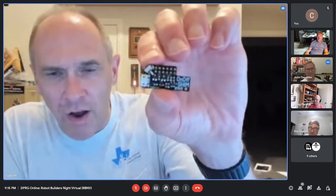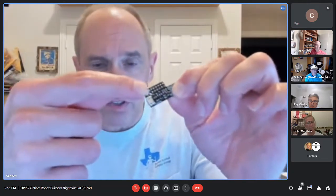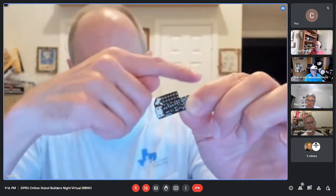Oh my goodness. So I would ask you, John, but the trouble is I went on a shopping spree and I got the Pimoroni on-off shim. I have several copies of this. It's not as capable as yours, but it comes with a script. You can mount this board. It's thin enough that you can cut the header away from the Pi, and you can mount this board on top of the header pins, and you can still put other things on top and use the header pins. You would then power the board through here, and then this button, I think, must have a similar function as your buttons. When you first apply power, nothing happens. When you push the button, it powers up. And then if you want to do a graceful shutdown, you push the button again, and the script in the Pi does a graceful shutdown.